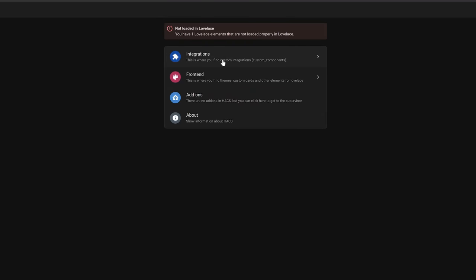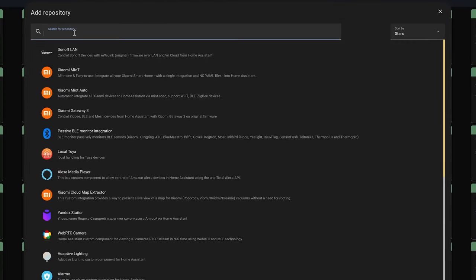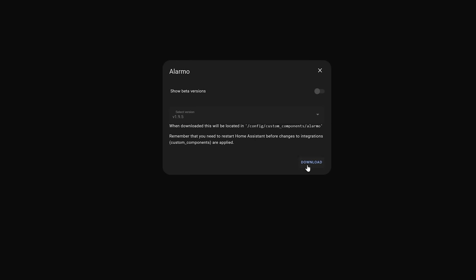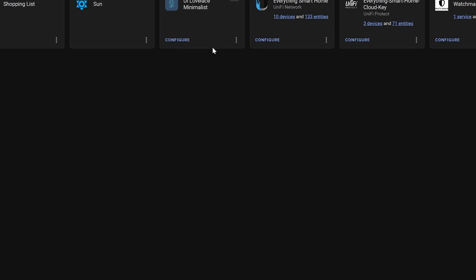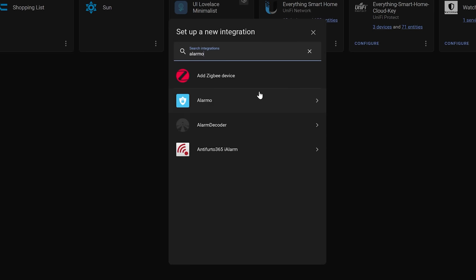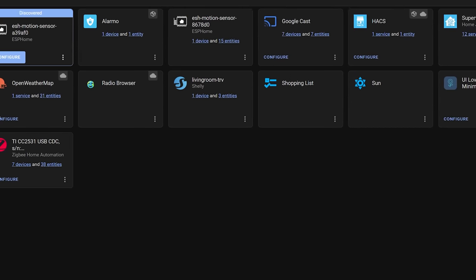First, head over to HACS in Home Assistant, which if you don't already have installed, I will leave a link to instructions on how to do that down in the description, and then go to Integrations and search for Alarmo and hit the download button. Then make sure to restart Home Assistant first for that to take effect, and then go to Settings, Devices and Services, add integration, and then search for Alarmo. Once Alarmo is added, you'll have a button in your sidebar that will take you to the Alarmo settings page.